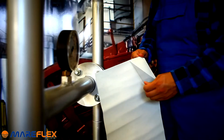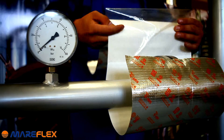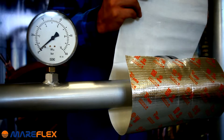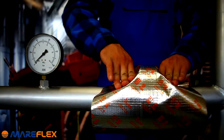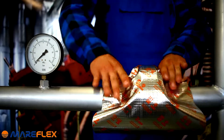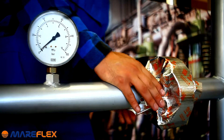We should make one and a half or two wraps with one wide piece of the tape. During the installation, it is vital to remember not to tighten the tape too strongly and not to push it into the cracks. The function of the tape is not to stop the leakage but to redirect the leak out of the protected surface.